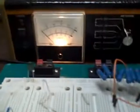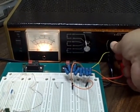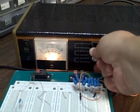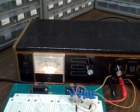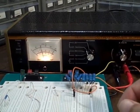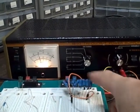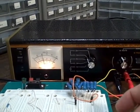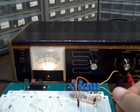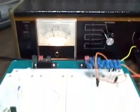As I adjust channel A, I'll bring it up to 5 volts. That's 5 volts on the meter. If I switch to current reading on A, I see that I've got 0.2 amps — and that would actually be right, because I have a bank of 8 200-ohm resistors. 4 in parallel would be 50 ohms, and two 50s in parallel would be 25 ohms. 5 volts over 25 ohms gives 0.2 amps. Yes, I thought I was right.